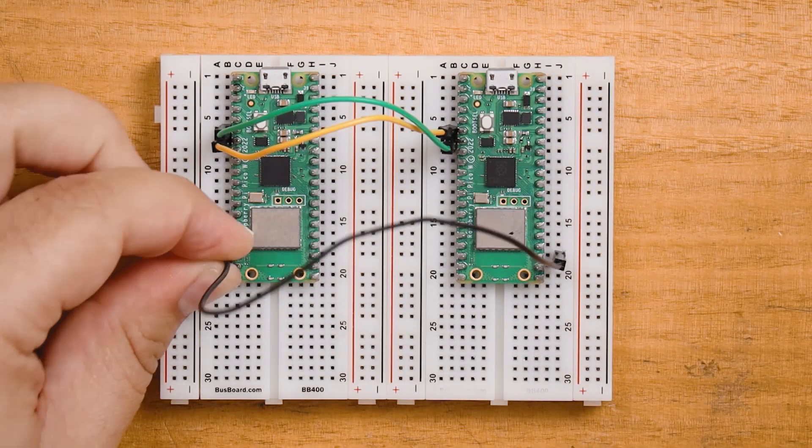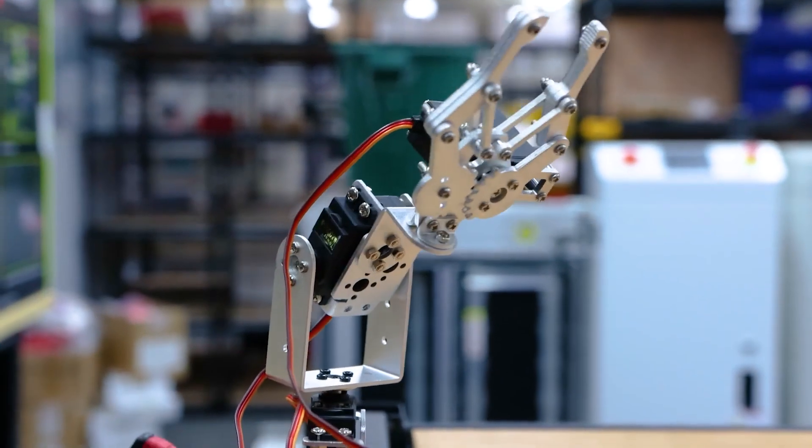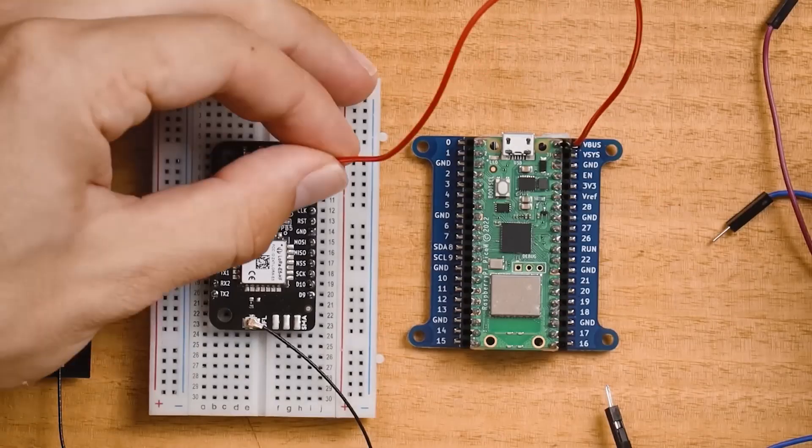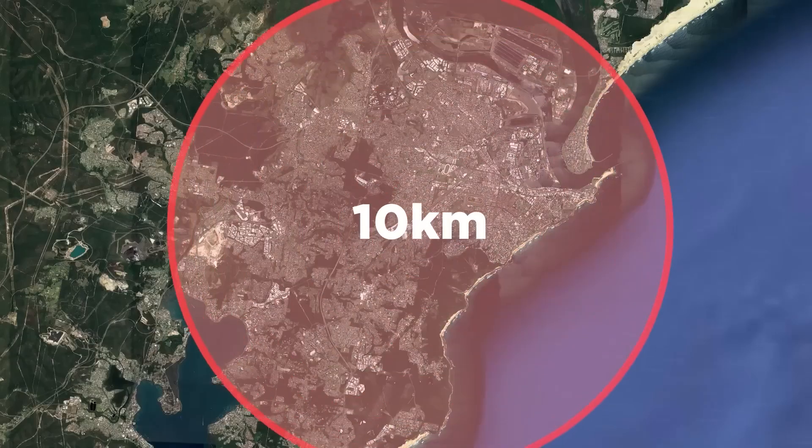But what if we don't want all of those messy wires? There are lots of ways to connect devices wirelessly, and one tried-and-true method is to add dedicated wireless hardware — kind of like connecting a long invisible wire between your boards. We have links on the workshop page to get you started with these. Bluetooth is an option — the same technology used for your wireless headphones and mouse — though there are more reliable and streamlined technologies out there. The Picodev transceiver makes things really easy: it can be added to any MicroPython board, has a range of up to a hundred meters, and just allows you to send data between two boards. LoRa, or long-range radio, is low power and can send small amounts of information one to twenty kilometers, or hundreds of kilometers with professional hardware.